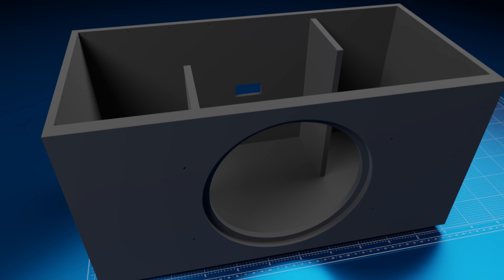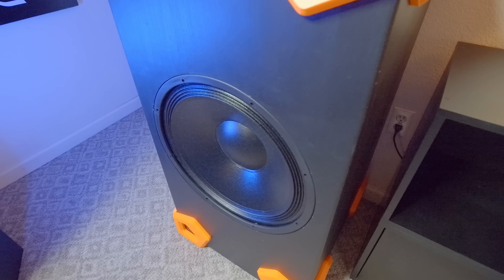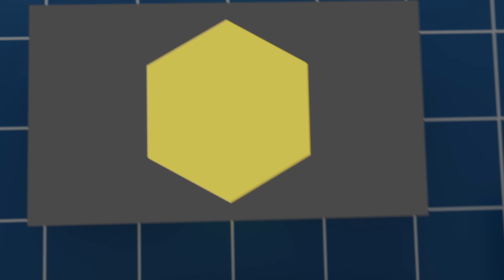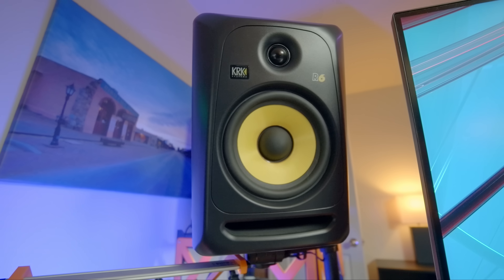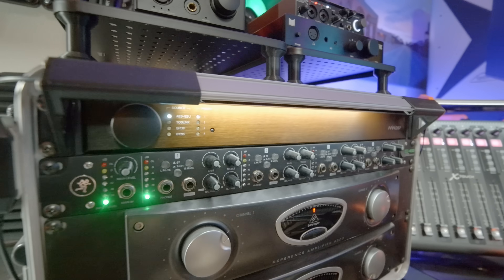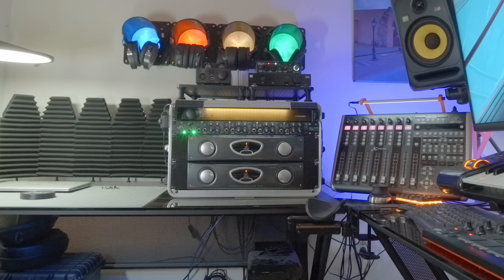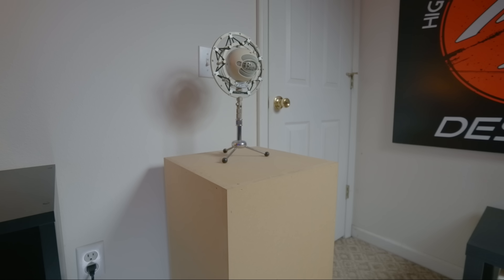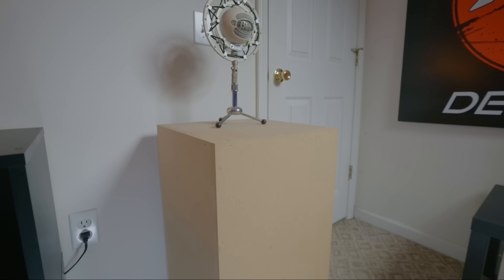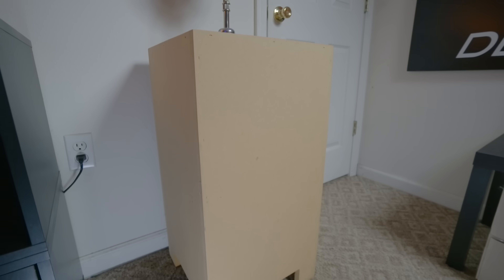In this video, I present a use case for sealed enclosures as I offer my take on the ultimate studio subwoofer. When it comes to places where I listen to music, this little area has by far been my favorite — just a passive set of KRK monitors in the near field, backed up by some DSP correction and the upper of these two amplifiers. The lower one, bridged to mono, powers a subwoofer along the opposite wall: a 12-inch down-firing design I threw together 8 years ago, gradually becoming preoccupied with what it doesn't do well, until eventually deciding to remake the whole thing from scratch.